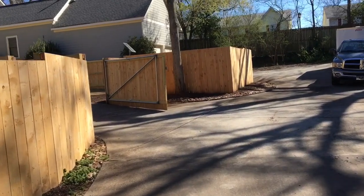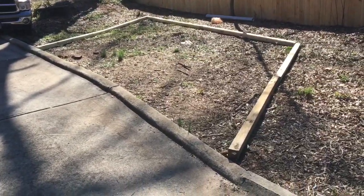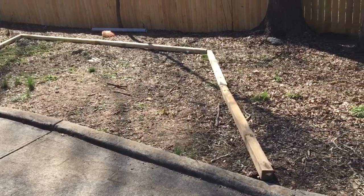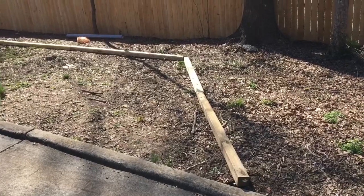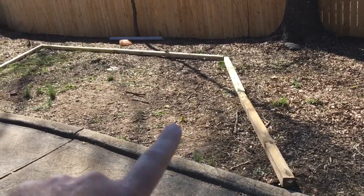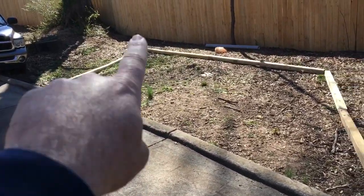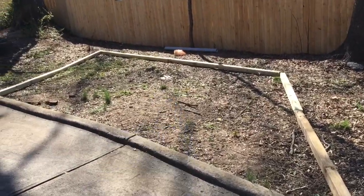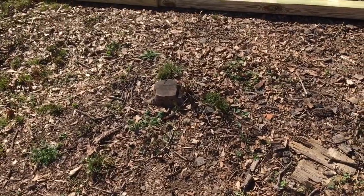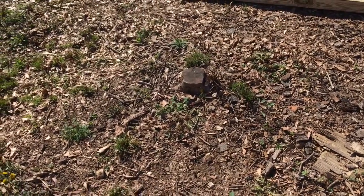So when you come up the drive, he just redid this fence and put an automatic gate in, which is nice. We do regular maintenance on his property — we've done this for years. This is the parking pad here. I got my pins in to get my markings and angles. With the four by fours, I've got to get it right because I've got all the timbers cut — I can't overshoot it and I can't grow a timber. So I measured it, put the spikes in, measure twice cut once. I've also got a stump right here in the middle — an old tree. I'm not going to dig that thing out. I'll dig around it a couple inches, get the chainsaw, and cut it as close to the ground as I can without chewing up my chain getting it in the dirt.